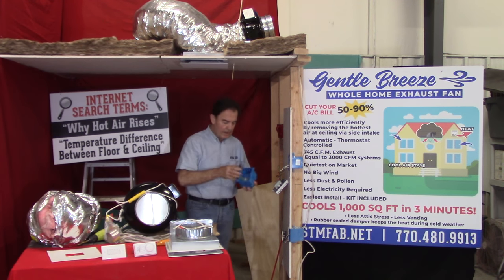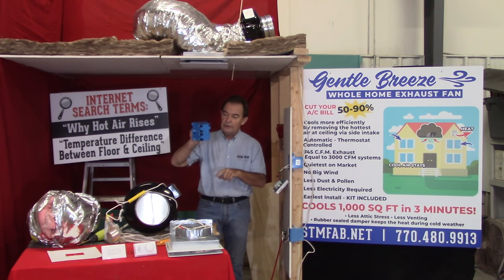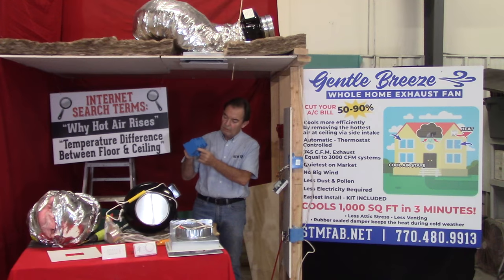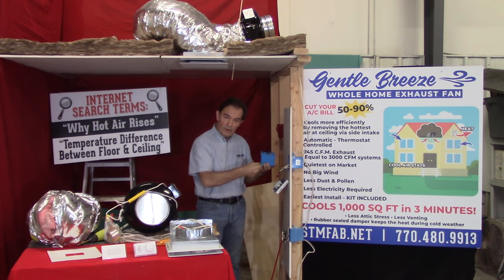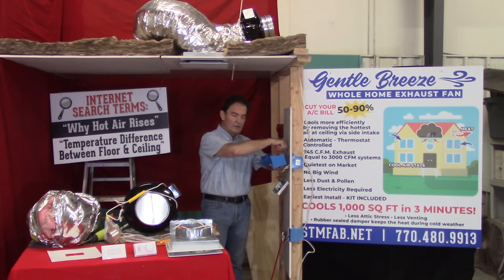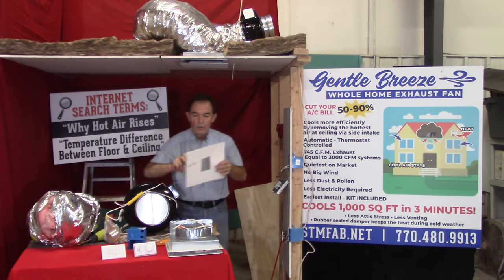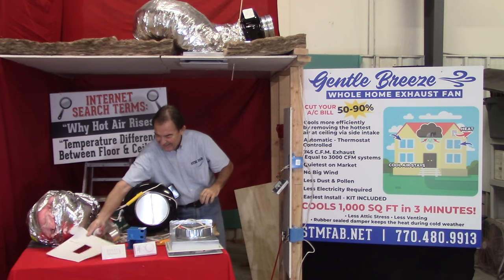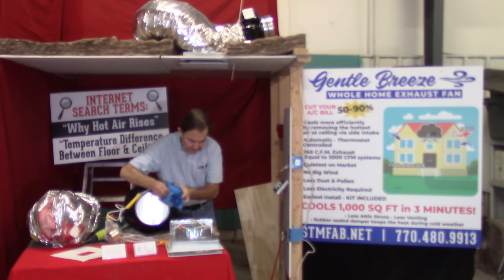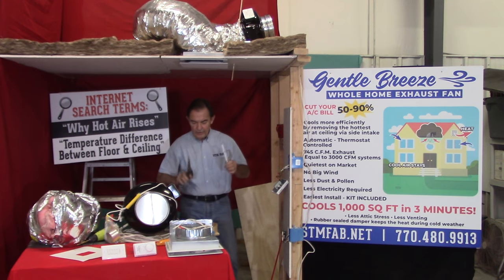You've got two old work outlet boxes that come with the kit and the system — both of them have been modified. These are the deep boxes, which are easier to use. To make it even easier, we've taken the blue plugs out — there's nothing worse than making the mistake of putting that box into the wall and then trying to jam the Romex wires back up, and then stuffing the box into the rectangular hole that you're going to cut with the old work box template.